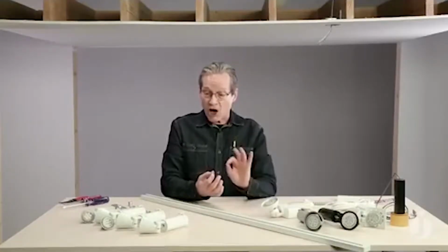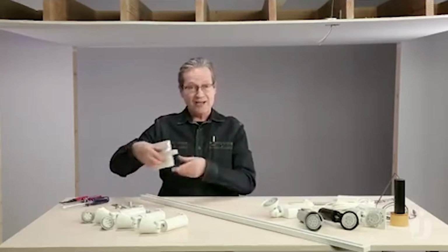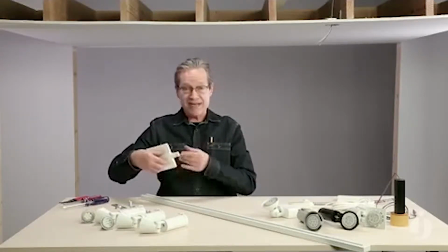We're all familiar with polarized plugs, where we've got the fat prong and the skinny prong that goes into the receptacle, and we know that that plug is only going to insert in one direction. Similarly, our track lighting fixtures and our live ends and fittings only go into the track one way. And the way that we understand that, the way that we designate that, is with a polarity line and arrows.